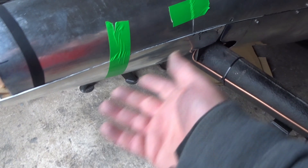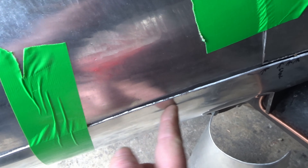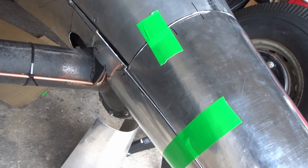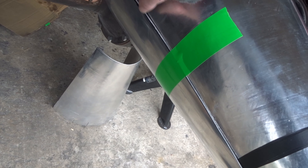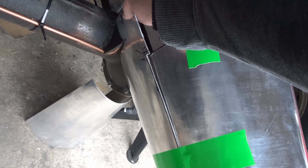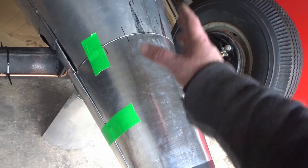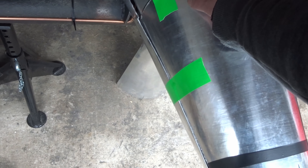I've been shaping the under panel here, bit by bit, getting it so this plate can come around and neatly meet up here. There'll be bolts here, maybe extending out with some steel behind. The question is whether to weld these edges or have a piece of steel that comes out bolted in. I might weld the edges but not this area because this panel has to come off. I want the whole tail section to bolt to steel around each side so I can take the whole tail off if needed — even just to prevent damage when moving on and off trailers. Also when I have it sideways across the back of the garage I can shorten the car, same with the nose.